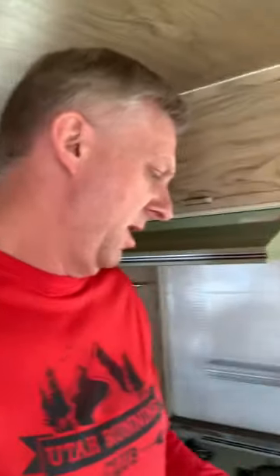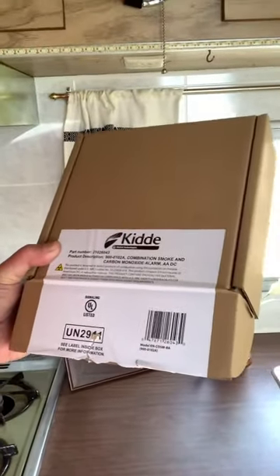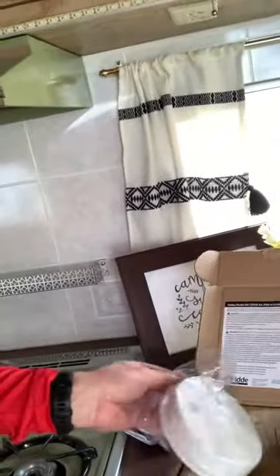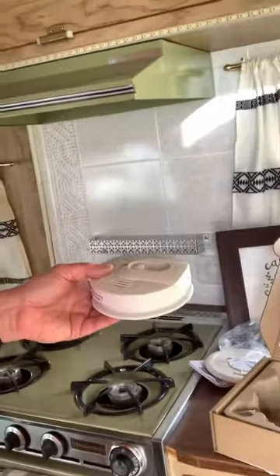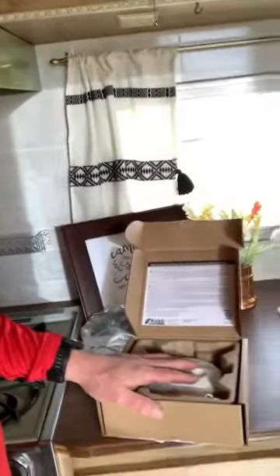One other thing I forgot to mention with regard to propane: I always get a combination smoke and carbon monoxide alarm. I get these on Amazon — about $24 each. The Kidde part number is 21026043. They test both carbon monoxide and smoke, which gives me peace of mind. Keep it a little away from the stove so you're not always setting it off, and put it somewhere logical up in the top of your trailer. Don't forget your smoke and carbon monoxide combo alarm, and also get a fire extinguisher just in case. Safety is always important when working with these old vintage trailers.